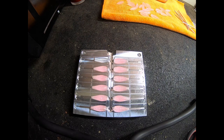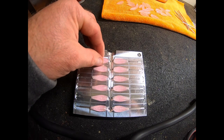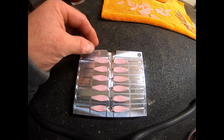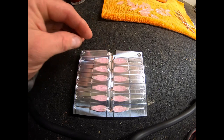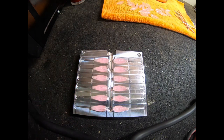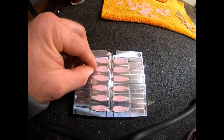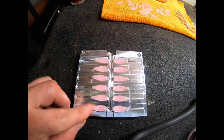The second and one of the most important steps in making these core shot baits is putting these bodies back into the mold so you can shoot the inner core and tail. Take your time when you're doing this. It is a time-consuming process, but the more time you take and the more pride you take in your baits, the better the outcome. You want to make sure that both orifices on both ends are open so the plastic will go through the entire body.